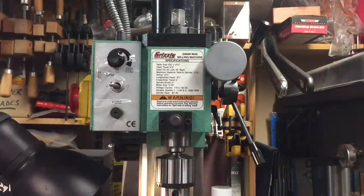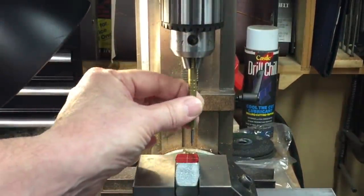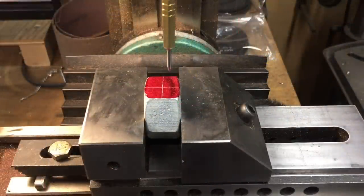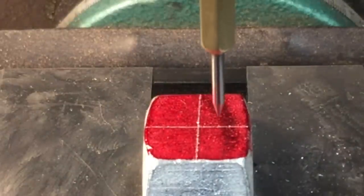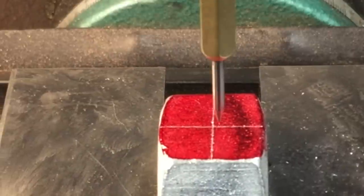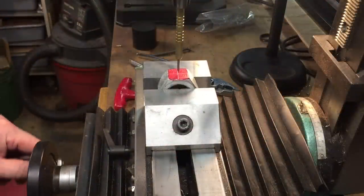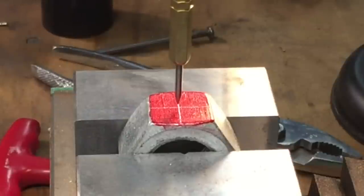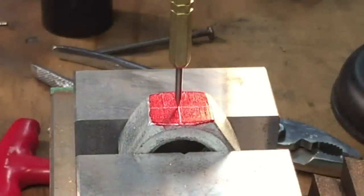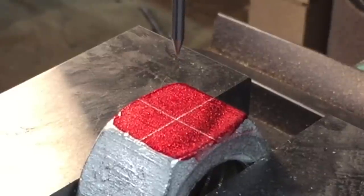Okay, we're over at the milling machine — this could be a drill press either way. I don't have a DRO, a digital readout. If I wanted to accurately drill right in the middle of that crosshair, I can put Randy's scribe — because it's a hexagonal scribe — right in my drill press and line up the hole. The first thing you do is stand behind one line, bring the scribe down very close to the lines, then move your table from left to right until you line it up. Then go 90 degrees and use the forward-back to line that other line up until you are perfect. Bring this down and that takes you right in the middle of that line — that's how you can use a scribe as a poor man's digital readout. Bring the point down to touch exactly in the middle of those crosshairs. Then take the scribe out, put in your drill bit, and you're ready.